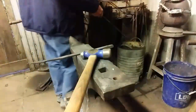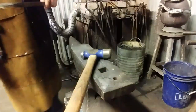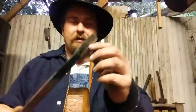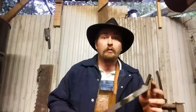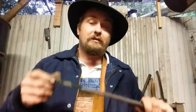You can see it started creating a little step there and it flattened that pretty good. It'll have its uses — the idea was kicking around in my mind and I had to build it. Here's what we got: folded it, welded it a couple of times, and squared it off. You could round that and make it like a little fullering tool. If you've got both hands free for hammer and tool and you have a striker or power hammer, making little tools of various shapes like this would be handy. I'm going to use this as a spot flatter — I can see that right now. I hope you gleaned something from this, maybe saw how I welded it and can practice your forge welding yourself — it's an essential skill in the shop. That's all I've got for this evening. Till next time, bye.